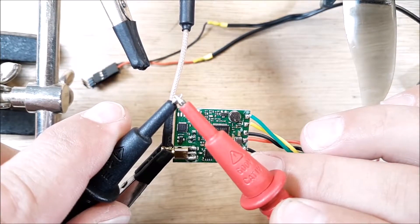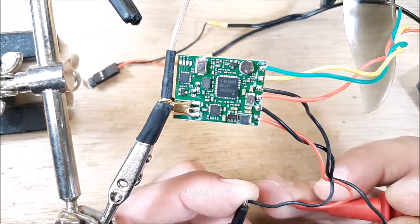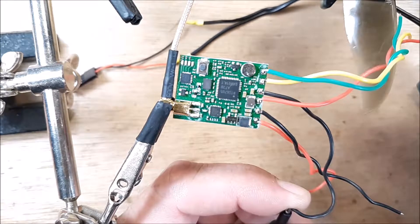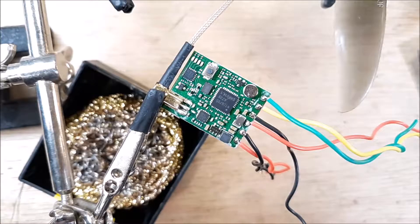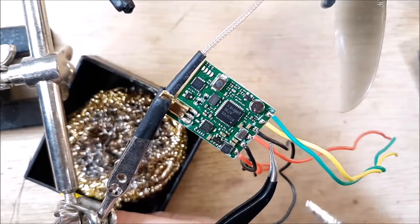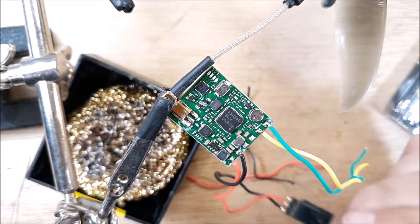You don't want that beeping sound while you're going through this. I'm just going to unwind the wires so they're not touching. There's no continuity going between the battery and the ground — that's good. We'll check the other side just for giggles. No continuity there either. If you do hear continuity, you're going to send it back without soldering anything yet. The next step is to remove the two wires I'm not going to use, since I'm not powering my camera from this VTX.